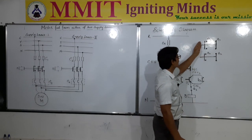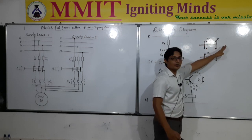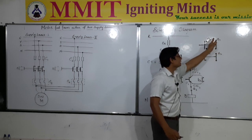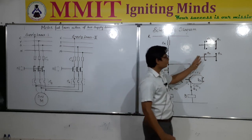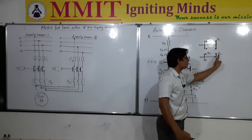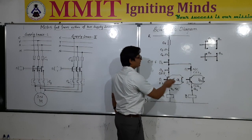When B1 is pushed here, the corresponding contact is also pushed — when this is connected, the normally closed contact becomes normally open. Similarly for B2: when I push it from the left hand side, B2 which was normally closed is going to become open. This physical interlock mechanism ensures that pressing either start button simultaneously disables the other source's circuit path.